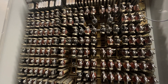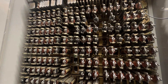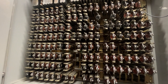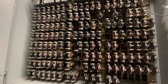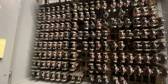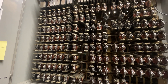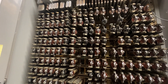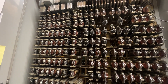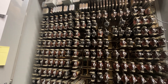My presentation today is showing some of the troubleshooting issues that I'm having with my 3CL switchboard sender. I have a relay that's got a short on a make contact, so I'm going to remove that relay and either repair it, find the short, or replace it. It's in a register circuit so that when I crunch in a number, I'm getting an erroneous outpulse — it's adding a digit 2 to the call.